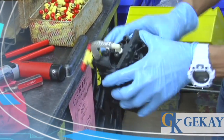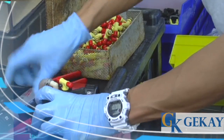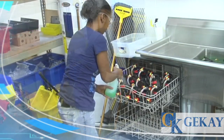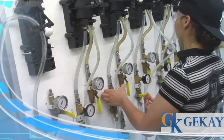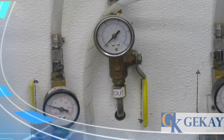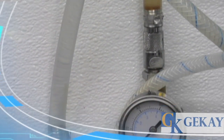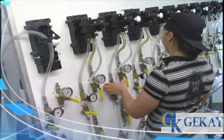Old fittings are manually removed and discarded. Pump outlets are sealed and the pumps are pressure washed for 30 minutes at 120 degrees. Pumps are installed on a custom designed test fixture where vacuum and pressure tests are performed to manufacturer specification. The good pumps are sanitized with BevClean for 15 minutes, flushed with filtered water, then blown out and sealed.